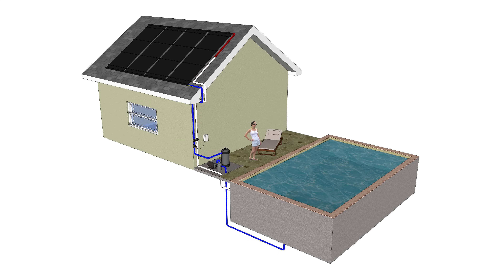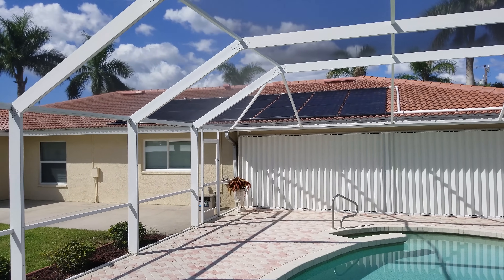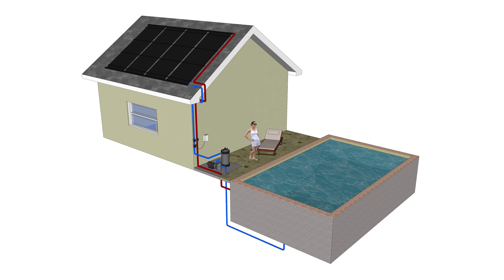Your pool will gain heat slowly, so don't expect to feel very warm water coming out of the jets. A little bit of heat gain and a lot of water flow promotes better overall heating. The good news is that once heated, pools act like a battery and store heat overnight, so the solar panels only need to recover lost heat the next day.